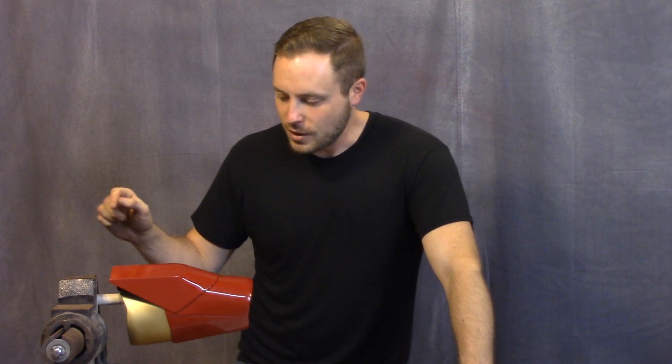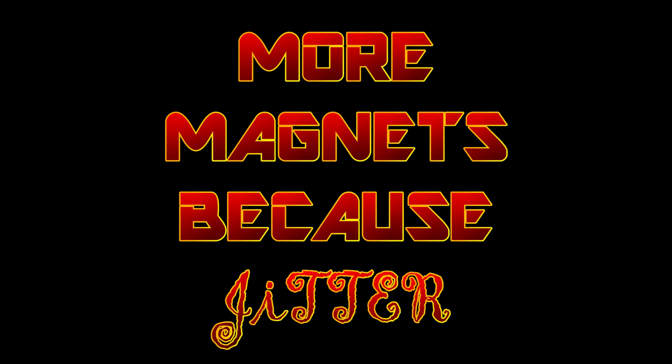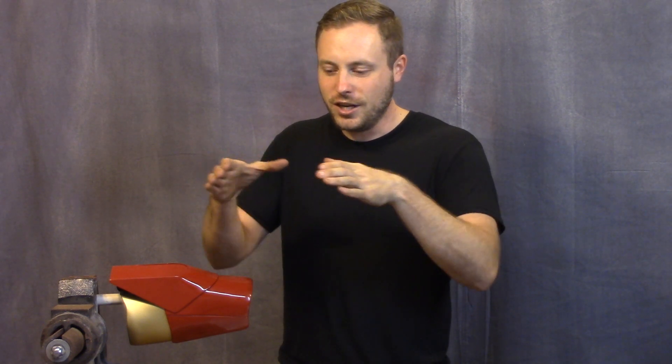I realized the easiest option was to drill holes and dremel stuff out of the way, use a long skinny screwdriver to take those screws out, and reposition the servo arms on the sides and top. After resetting the control arms to the next spline position on the servos, everything shut the way it was supposed to — but then pressing the switches caused jitter in the servos, so it would close and then jitter back open a tiny bit.